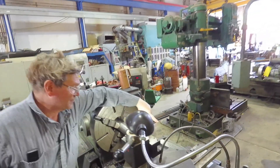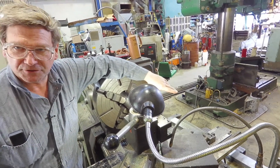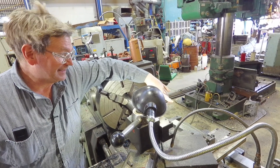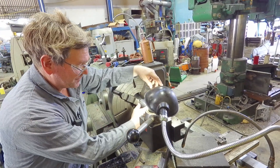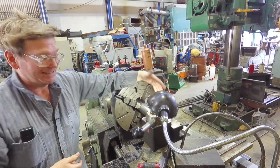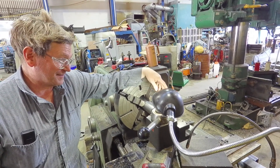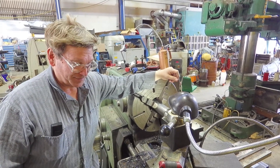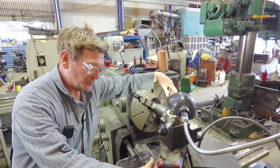On this compound, one thing you can do to take up slop so it's not a problem as you reverse direction is to mount an air cylinder on here that preloads everything. A friend of mine tried that recently but had some problems — I think he pushed the cylinder in the wrong direction. You don't want the air cylinder making the cut; you want the solid iron to be making the cut and the air cylinder pushing against it to keep it out of the cut. It takes a lot of thinking about all this stuff. Taper attachments are good to have on a lathe but they're not perfect, and a lot of times they take longer to set up than what it's worth — if you're cutting a short taper just use your compound, it works fine.